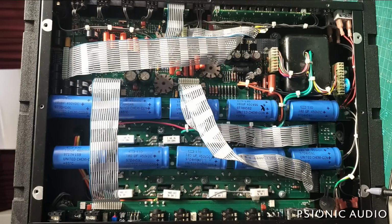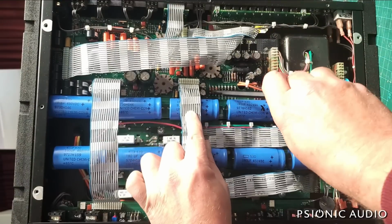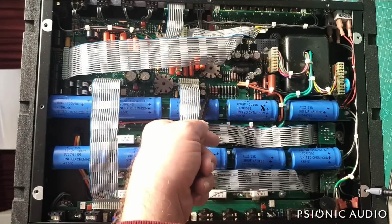Now that's the Prodigy, but that is powering this B plus node. And if that is a faulty resistor, that could give us this problem. The issue being that the service update I have for the Prodigy model has R106 right here, and the board layout is different here. And this is not a 10K half watt.